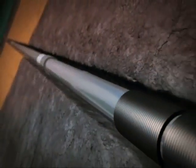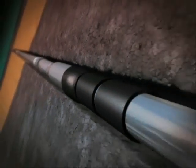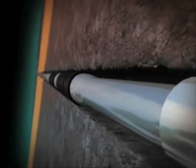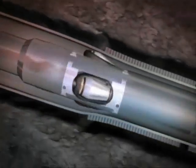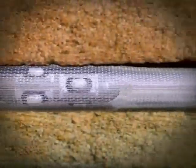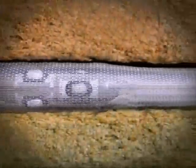As expansion of the sand face completion continues, borehole contact eliminates the annulus between the completion components and the well bore. This action compresses the EZI joint elastomer against the well bore to create a seal.